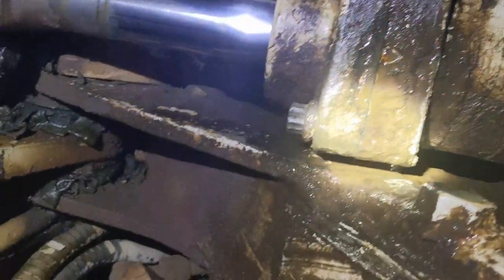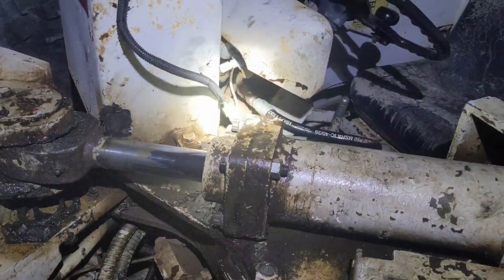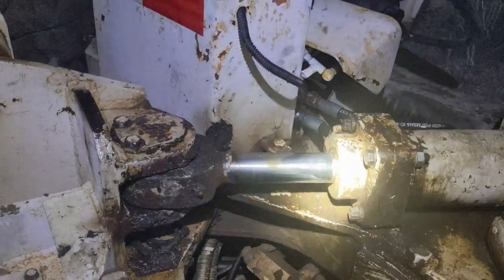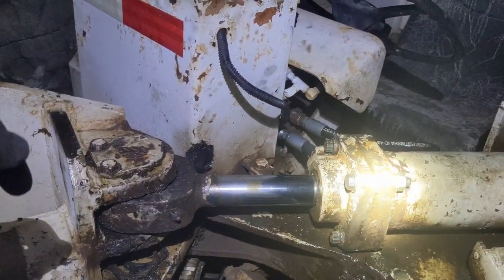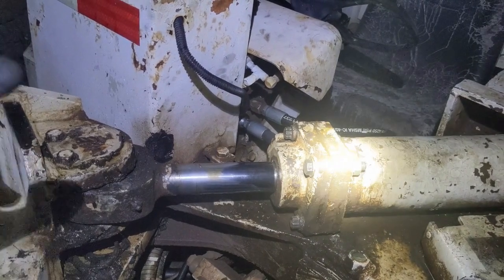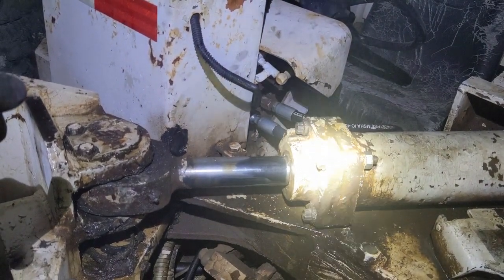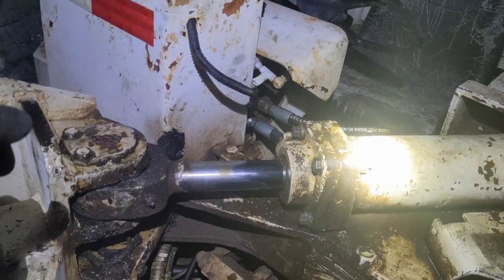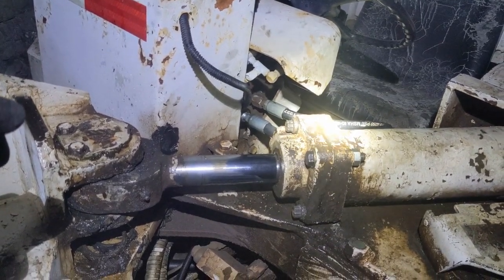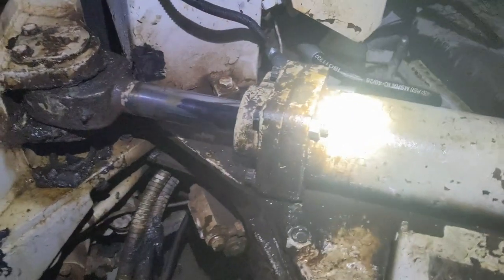That O-ring is definitely bad — you can see it was coming out from down around there. We aimed the break in the O-ring so that it wasn't spraying towards me, which was a risk, but it worked. So now we're going to pull the front pin, pull the cylinder bolts, and bag up the piston and the cylinder body. Tighten it down with some zip ties or twine just to prevent any kind of contamination from getting in. Take the ram and the bad bolts to the hydraulic shop and go from there. We'll probably need to pick up a tap for whatever size we go up to — I think there's too much damage in there to get away with reusing the old hole.